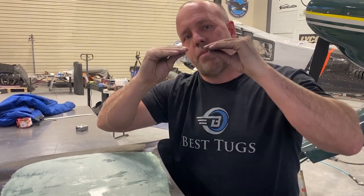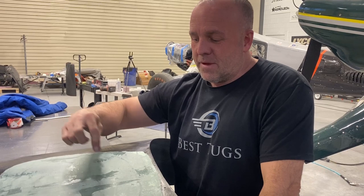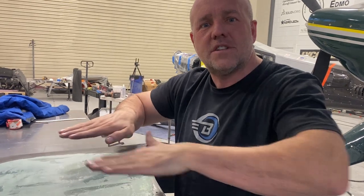Now the hinges pinch between both sides of the carbon. I didn't mention it before, I don't think, but of course the hinge line, I put duct tape on both sides and cut it right down the pivot points, right off the edges, and then layered the duct tape up. You wanna make sure that whatever tape you use, you make it as thick as the carbon that I slid in and touched that tape.